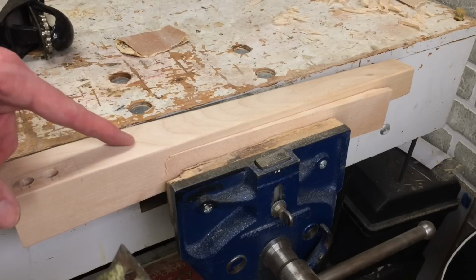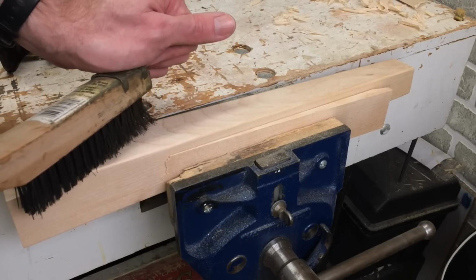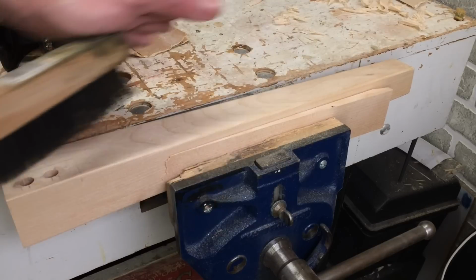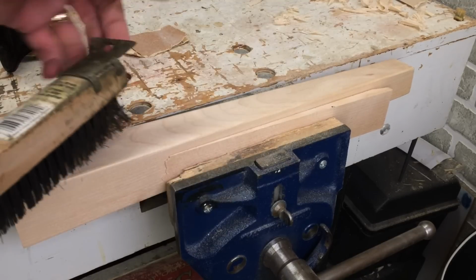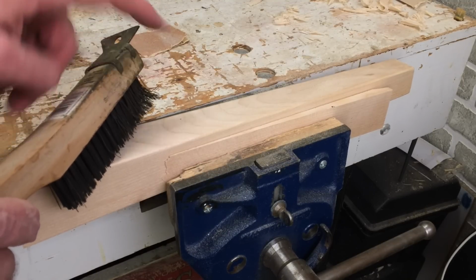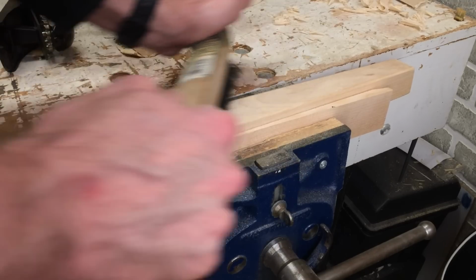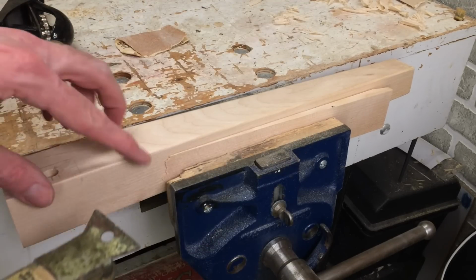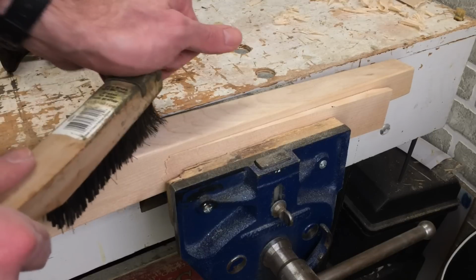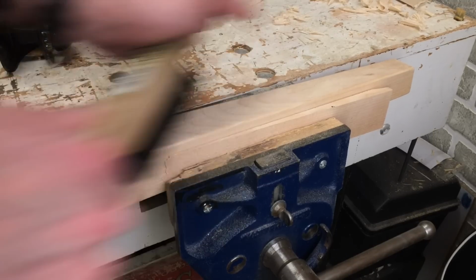I've wire brushed three sides here, and I'm learning a technique. If I push it down here and just move it forward, it's kind of smooth. So listen to this. But I find if I pitch it on a bit of an angle towards the direction I'm going, there's a bit of chattering. Listen to this. And that seems to be more effective in creating this wire brush marking. So if you want some texture, pitch it a little bit back. It'll make it much more effective as you're doing this.